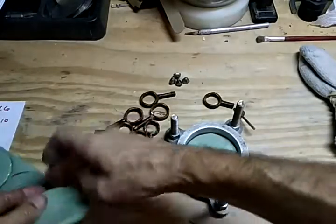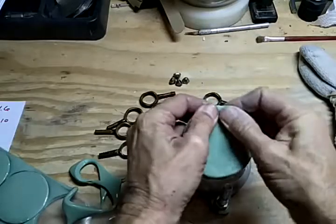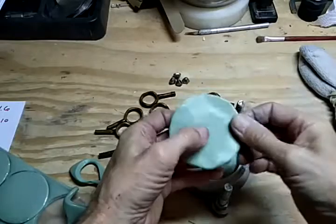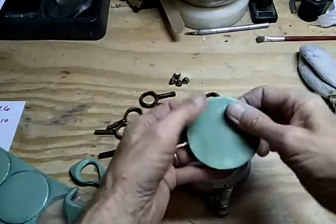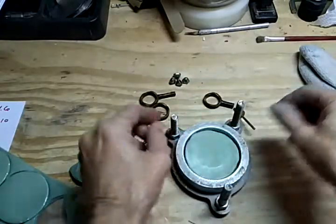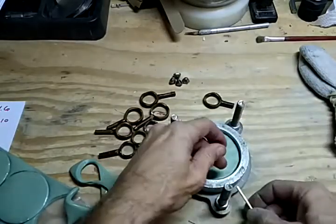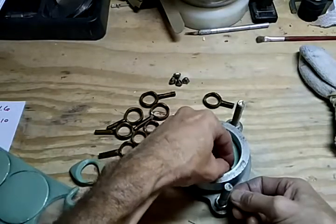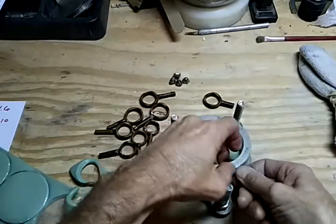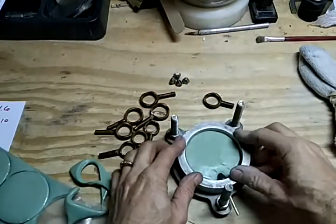and then we grab another piece. What's great about this mold rubber is that it's nice and malleable, and that'll work great for pieces that are bigger or that have intricate areas where it needs to get up inside. This piece here doesn't get the talc, and that goes in, and then we take the brass cone and the brass rod, we fit that through there. There's a hole right here. So that fits in like that, and it goes down.